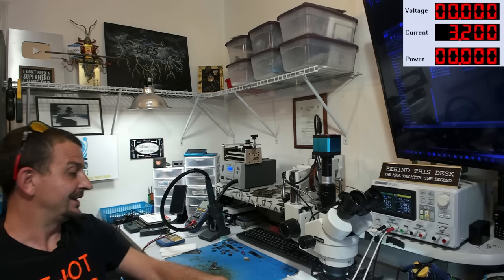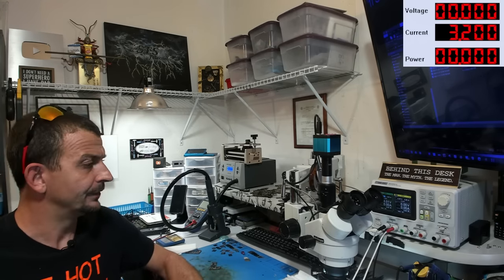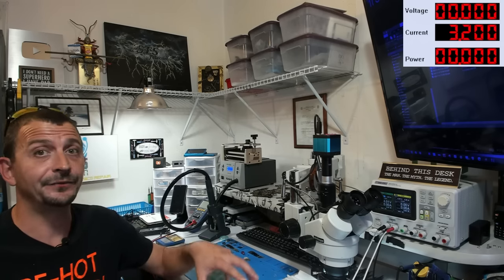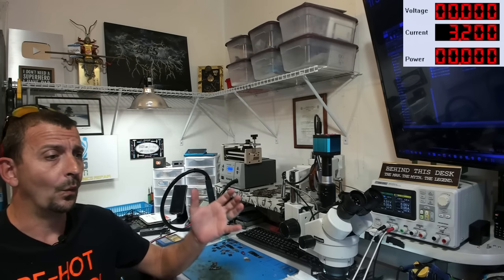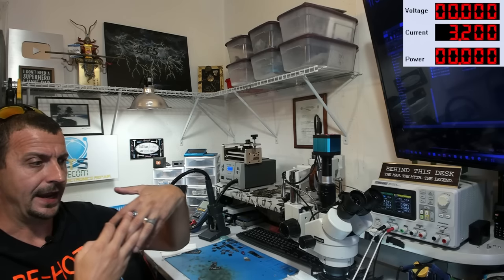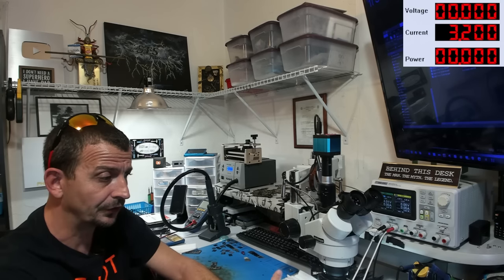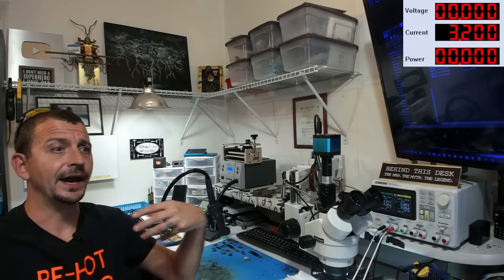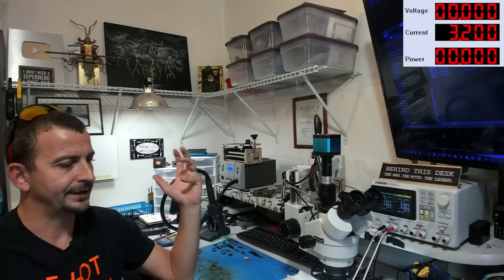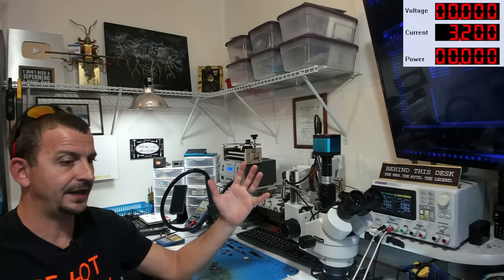So gosh, one more thing before I go. One of the most important things that I have learned about this level of rework is actually knowing whenever it's your fault. For example, my last two board transplants were for iPhone 13 Pros. One of them was, I don't know what happened to it, but the whole board was twisted real bad. And the other one simply had a dumbbell dropped on it. And long story short, I did the one that was twisted real bad first, and I came up with a brain dead CPU. Like, what the heck? Everything went perfect, no missing pads, I just cannot figure out what in the heck.